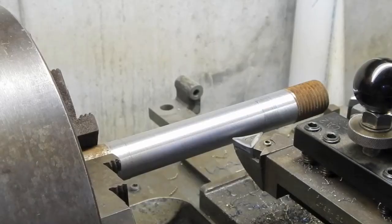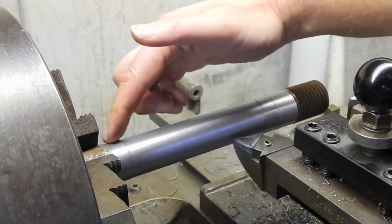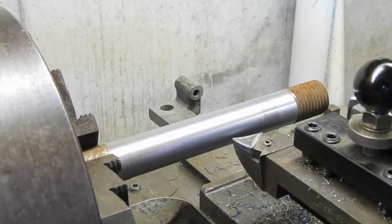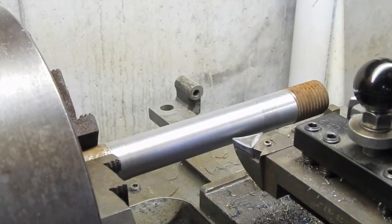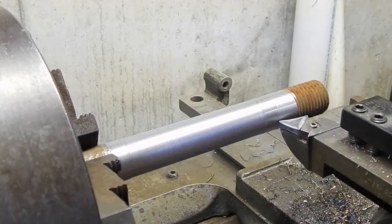I should try another cut. What I did was clean this up, establish this area as my first collar and this area as my second collar. I undercut this further, installed a brand new carbide cutter, and reset the center height dead-on. Now I should be able to take a really light cut. Supper's ready, but let me knock this out first - maybe go eat with good news.